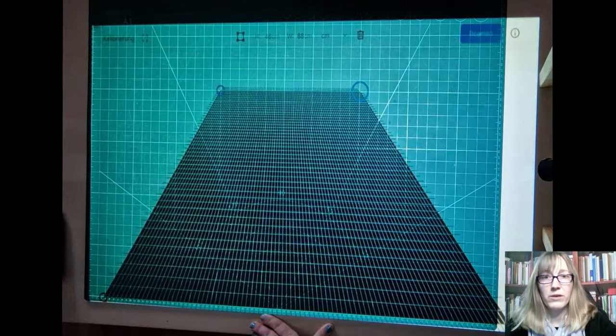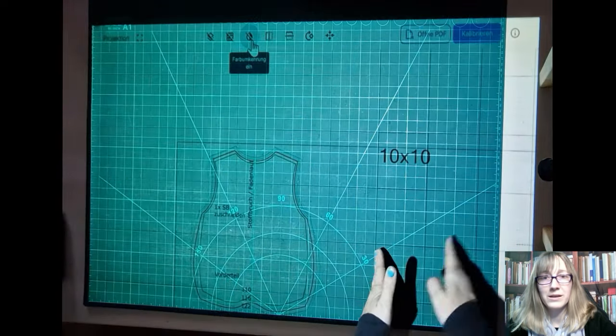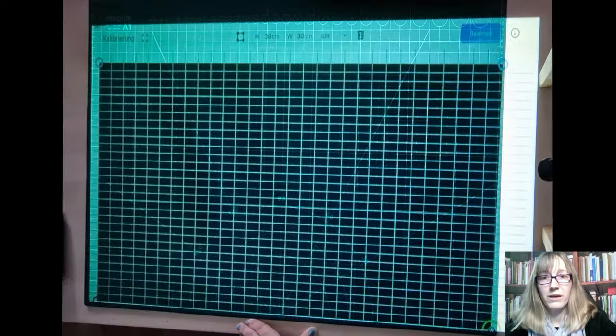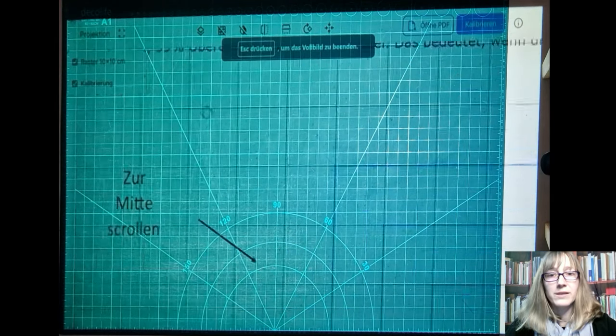You shouldn't just calibrate a small area. I'll show you here — I calibrated an area of 30 by 30 cm and you can see when I look at a file that it runs off to the sides. That's because it can't be calculated accurately enough. You should therefore calibrate the largest possible area. If you see when you project a grid that it does not yet fit 100%, then it is best to correct the corresponding edge lines again with the arrow key slightly inwards or outwards, depending on whether the line shifts outwards or inwards. I still find this much easier than trying around with zoom, as zooming always changes the entire area while this only changes the corresponding lines.